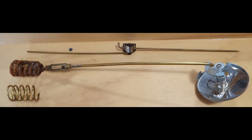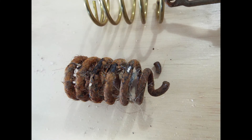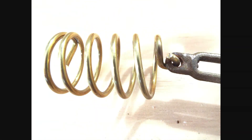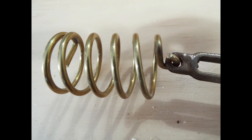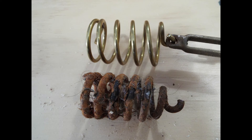They've gone to the toggle. We tried the toggle — we don't like it. The mechanical advantage is much better with the unit that we've got that rotates. You can see the cam assembly. So we decided to just keep everything except the spring. That spring was so tough we couldn't bend it to get it off the turnbuckle, so with a hacksaw I cut the tip off and got it out of there. Then I bent the new spring so that it would go into the toggle, and with some vice grips, squeezed it together so that it would stay on the toggle. It's easy to see the difference between the two springs side by side — it will not clog nearly as fast as the original spring.